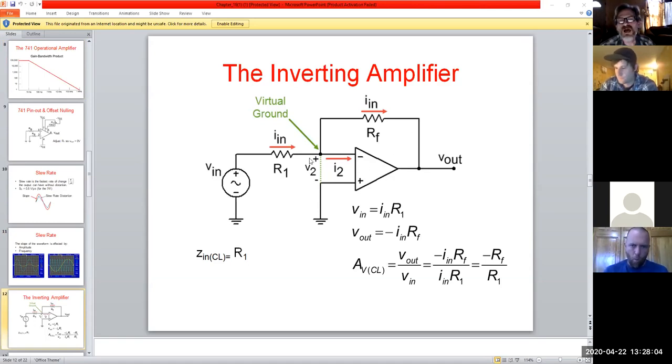Right through there. And so some of the things we need to know. If you notice the very first one we're dealing with, it's Ohm's law, right? So we have our voltage input, which is this guy, and then we have our current, and we have our resistance value right here, straight Ohm's law. And we look at our output. Because we're going into this inverting, this minus sign, see how we add that in? So our output would be considered a negative, which would mean to us what? That our AC signal is literally flipping 180 degrees, right? That would be an inverted output, if you will.